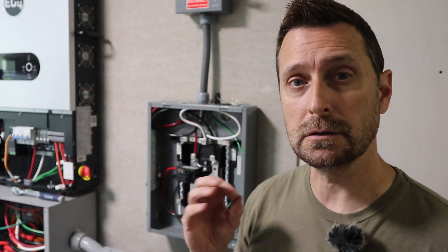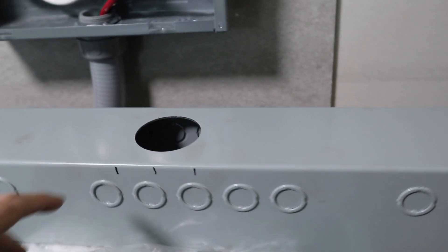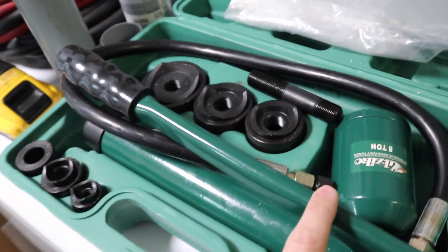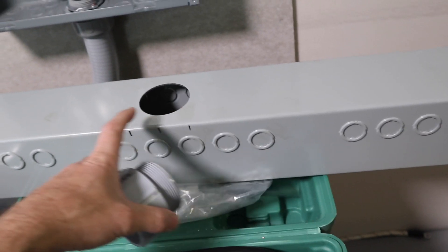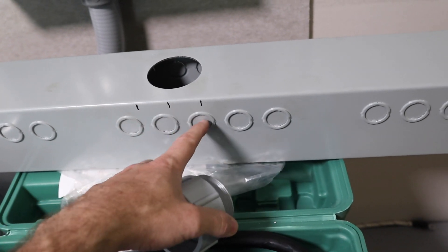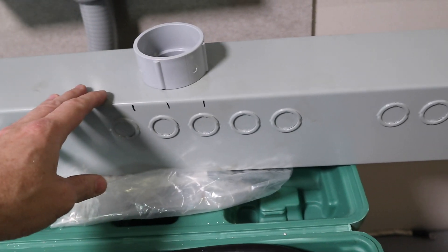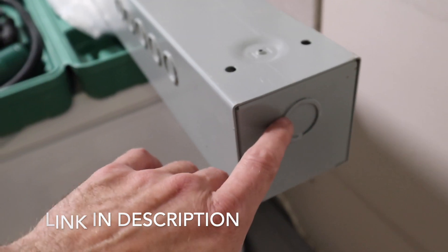If you are interested in this inverter and these two great outdoor products, make sure you check out the link in the description below the video — there's a coupon code down there as well. We've got our hole through the wall and we've got our new conduit box. I needed to match up that hole with this punch out right here, and for that I needed to get this hydraulic punch tool. This has instantly become a really handy item because these raceways or wireways or conduit boxes usually don't come with very large punch outs. So if you need to bring something large into the box like this 2-inch conduit coming through the wall, you need something like this — I'll leave a link in the description below.